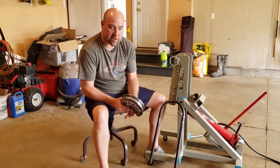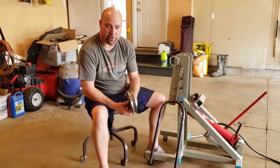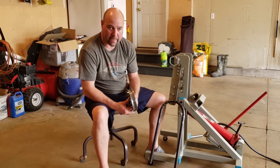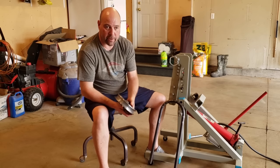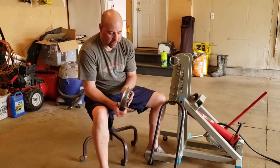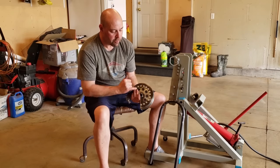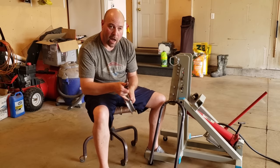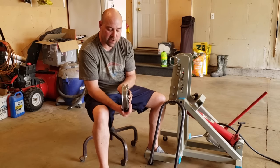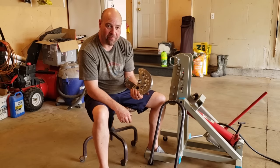Jackson has an extensive background in 3D printing and durability testing — he used to do durability testing on 3D printed prosthetics for several years, designing machines for impact testing and evaluating different materials. That's why we settled on PETG for this rather than the PLA we use on the CNC plasma cutter. PETG is very strong. We also sliced it so that the perimeters of the through holes would align with the perimeter of the arc — so there's technique to how it's sliced and how the infill is done. For us, it's a $10 die. Hope you liked the video — please subscribe and like to help the channel out!